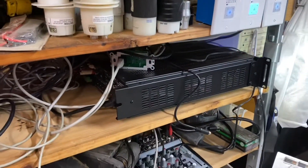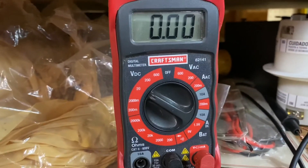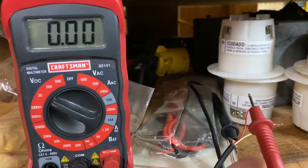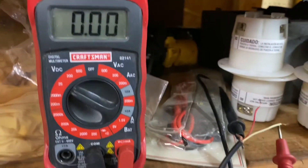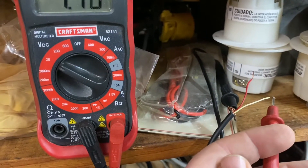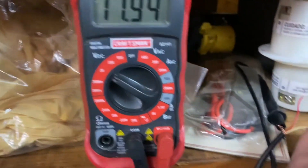I'm just going to cut this 1/8-inch cable and make a switch that I'll put up here — nothing extraordinary, but we'll show you how to do it. I've cut the 1/8-inch cable coming out of the external out. I have the shield wrapped around our ground. I'm going to use a voltmeter set on DC at 20 volts since it won't be over 12 volts. Touching the white wire — no voltage. Touching the red one — no voltage. The reason is you have to have at least one zone turned on. Once I turn a zone on and touch the white wire, we have 12 volts. The red has nothing.